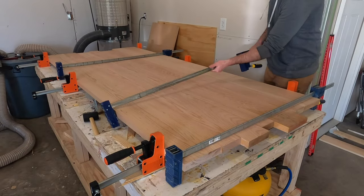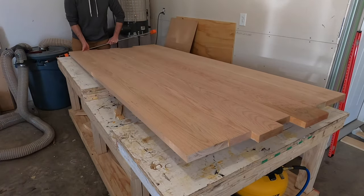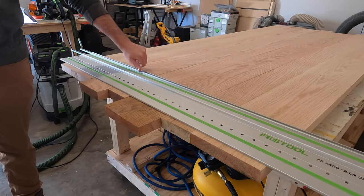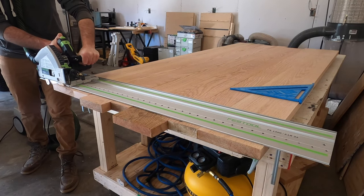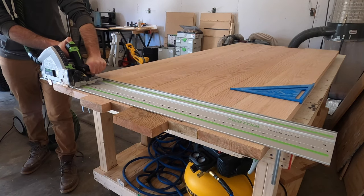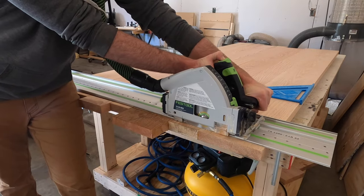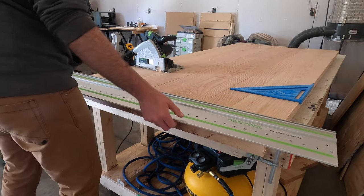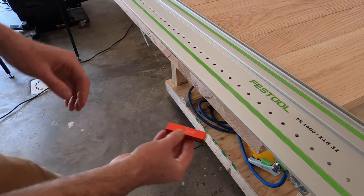I left the clamps on until around the same time the next day in order to ensure that the glue was completely dry and then I wouldn't have any surprises whenever I took the clamps off. Next I used my track saw to flush cut one end to make sure that I had a straight edge on the end of the table. If you're wondering why one of those boards is sticking out way more than the other boards, that's because that board was a little bit warped and I wasn't able to get the end of that board on the jointer whenever I was milling those up. I intentionally left the boards longer so that if I had any issues on the very end I could just cut them off with a track saw.